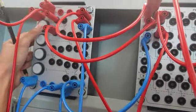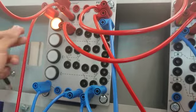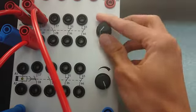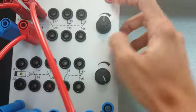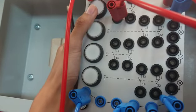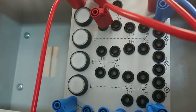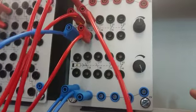So when we open, okay, bismillah, open. Okay, immediately, guys, it turns on. So it means 1 second on delay. Back to the position. When I switch to the middle, over here, can you see? Is it middle enough? Now we turn on. Now let's count 5 seconds. Okay, see? It means that it is a 5 second on delay application.